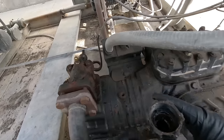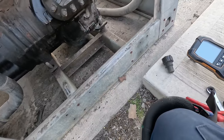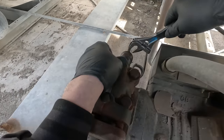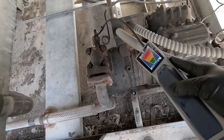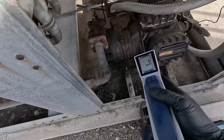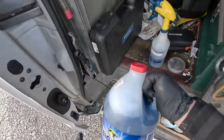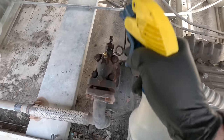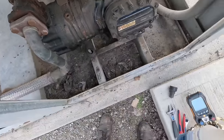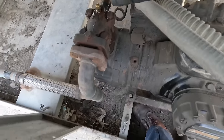Got a little rubber seal in there. Even with the bigger wrench, it won't fit that - you can use a crescent wrench. It's fairly tight and it does have a packing nut on there. Let's scan that and see if we get any leaks on the packing nut area. Well, of course we do - that's nice. We're in PPM mode. Generally what we got is big blue. Let's go ahead and soap this thing down. It's not bubbling hugely, so we can try to tighten that packing nut just a touch. There we go - we'll see how that does.